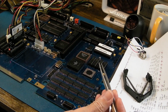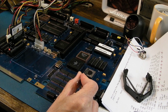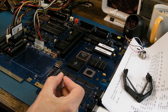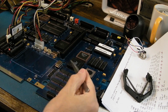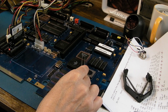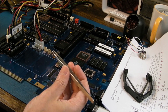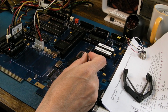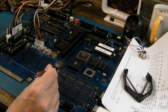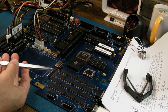But other than that, and me addressing this thing with the FPU, because like I say, the way things are at the moment, the FPU is going to run at 50, my FPU won't go at 50. The resistors here, the right hand sides of them are joined together. And I think the key here from the RAM side of things is there must be something in the equations there that are based on clock speed, maybe, I don't know. It's strange, isn't it, how 25 would cause it to not work, 50 would work. So I don't know, maybe it's because this is not documented. Maybe I'm just making some assumptions. I don't really know why you would have an alternate position for that resistor.